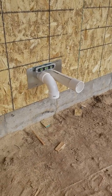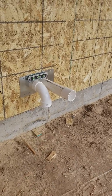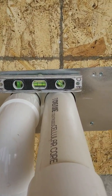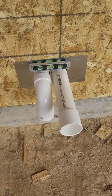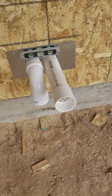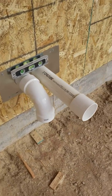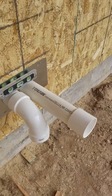In this video we're going to give you the quick basics on how to run the PVC flues for the furnace venting. Rule number one: make sure that your vents are level when they come out of the house, otherwise when you go to put on the concentric kits they will look horrible if they are crooked, or you might not be able to put them on at all. For the exhaust you need a screen and a coupler; for the intake you have an elbow, and you want the exhaust to stick out six inches past the intake. That is how it looks on the outside of the house.